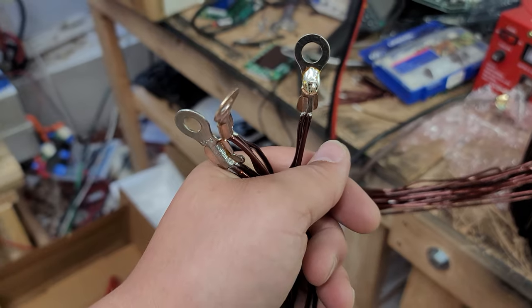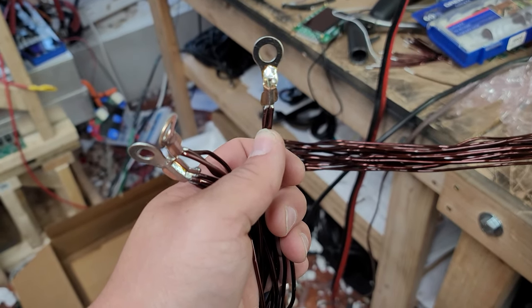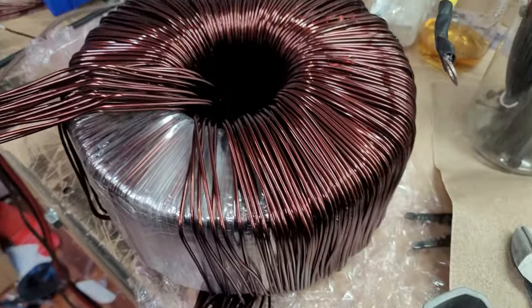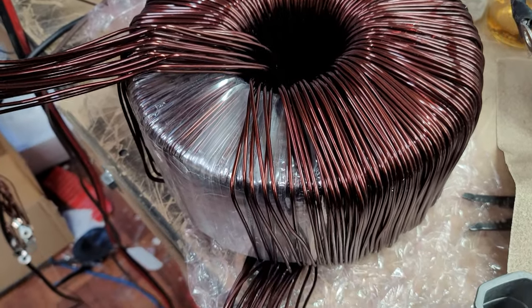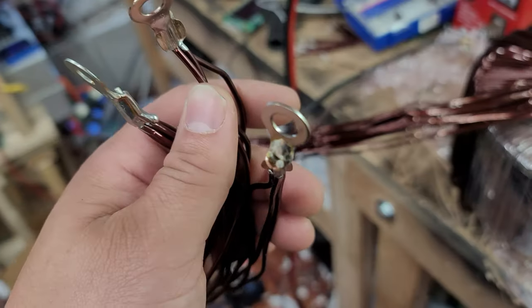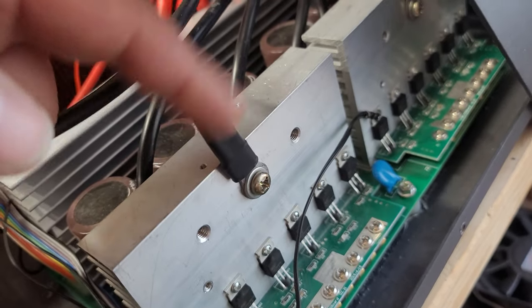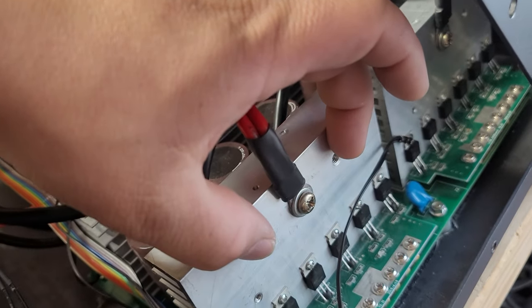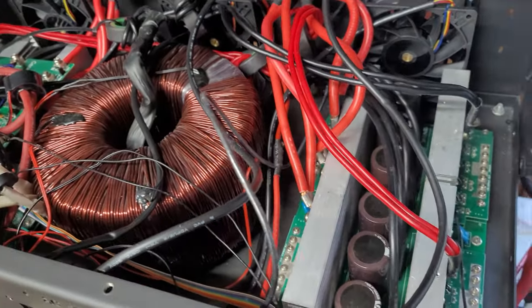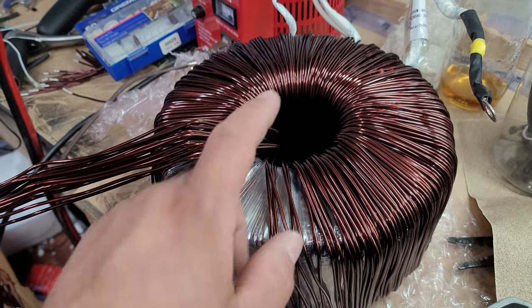There are 22 strands on each side, so I had to get creative. I've got four sets of three and two sets of five — that's 22. What I'm going to do to equalize between the two main boards: the new 10.3 main boards only have three mounting spots, so I'll have one of the fives and two of the threes on each board. That will equalize everything between the two main boards as best as possible. This will be a good baseline to determine whether this transformer is going to be adequate for our 10K units, which I already know it is.